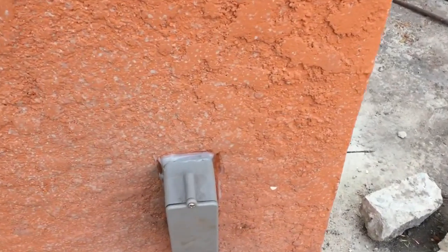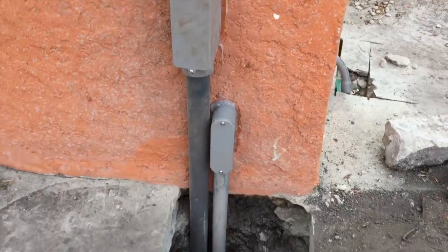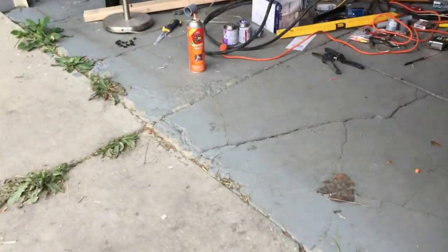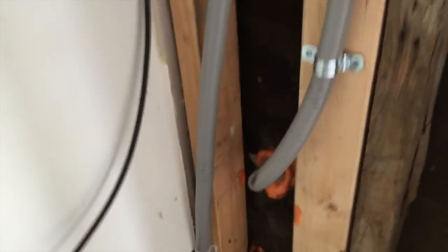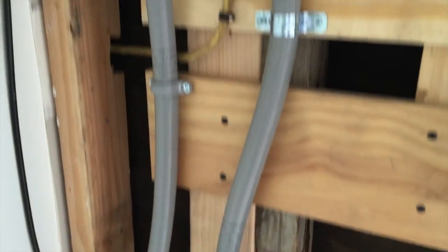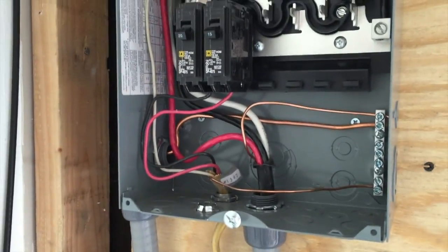The mini panel in the garage is capable of 100 amps. I have three 20-amp circuits in there right now, which I think is a little overkill since I don't have a shop or anything. There's either a 4-gauge or 6-gauge bare copper wire as a standalone ground for the garage, which is required by code.